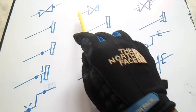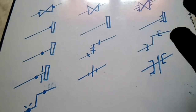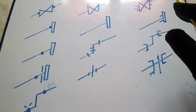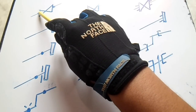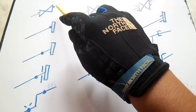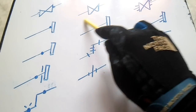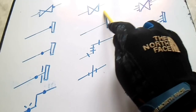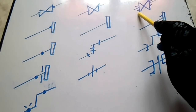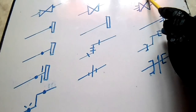You can see the gate valve looks different from the others. We have three gate valve symbols, each with different joints. If you see a dotted line, this is a butt weld. This is the normal gate valve symbol. This one with no dotted line is a screw joint — remember this. And this gate valve with a line here is a socket weld.